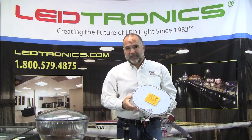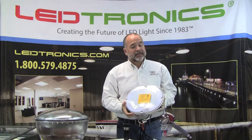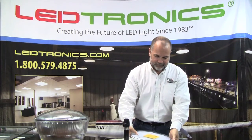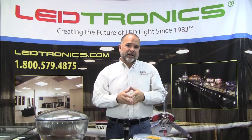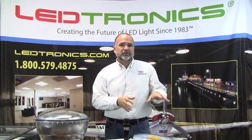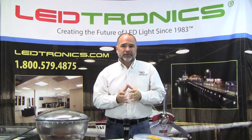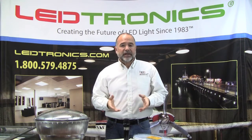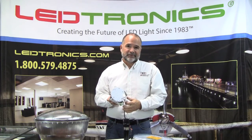You can see it's a little bit larger of a unit. It's got two different drivers as well. This is a 480 watt consuming device, coming close to replacing a 1500 watt metal halide. When you call LEDtronics and talk to us about the LED retrofit kit and how they can help your project, we're going to ask you a few questions. We're going to help you qualify the application to make sure these units are going to work well for your fixture. The volume inside the device you have will dictate what size unit we can get in there for you. If you have any questions about our new LED RK retrofit kit, please just give us a call here at the factory. We look forward to helping you with your lighting solutions. Thank you.